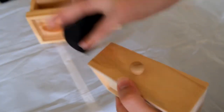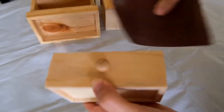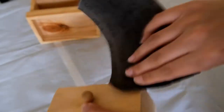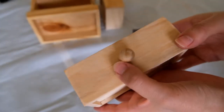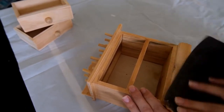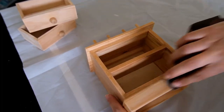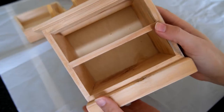So the next step was to really sand down all of the sewing box. I used 80 grit sandpaper here, which is a medium grit, and it really helped in removing some of the varnish that was on the wooden box. Now with the paint I used later on, you don't actually need to sand down the wood, but I wanted to just to bring it up and see if I could make the wood paler before painting. Sanding it all down worked well. I tackled the inner drawers first before moving on to the actual base of the sewing box, which was a little bit trickier to sand down and did take quite a bit of time. But I think it sanded up well using the same piece of sandpaper throughout.